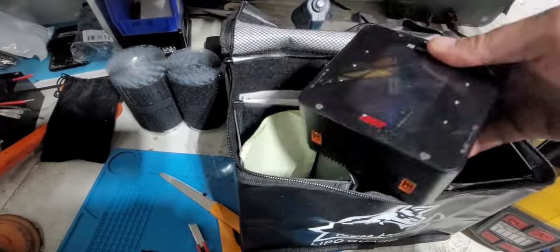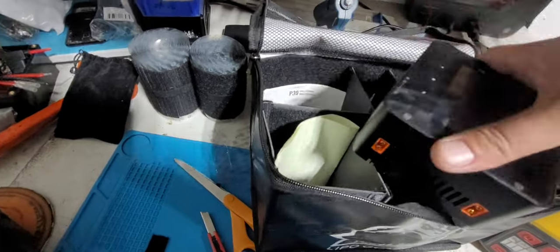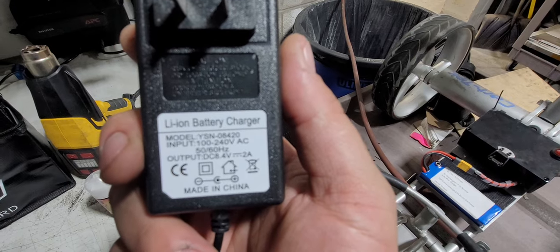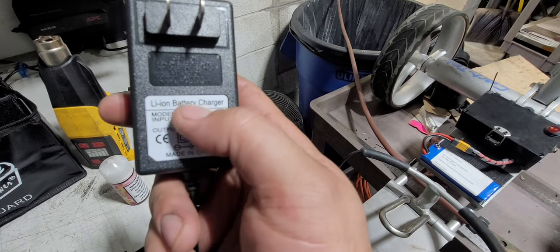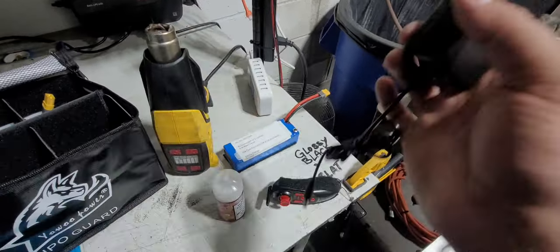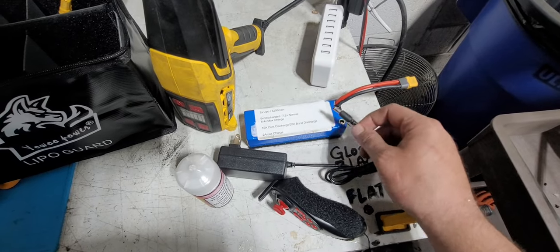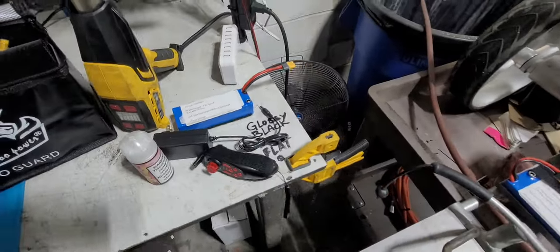But this golf bag carrier is for my boss, and my boss would rather have simple than fun. So instead, I bought an 8.4 volt, 2 amp, lithium ion battery charger. And it has a little light. It's green when it's charged, and red when it's charging. And then all I did in here was add a barrel jack so you can plug this in, and a BMS to control the balancing and all the safety features like low voltage cutoff and all that type of stuff.